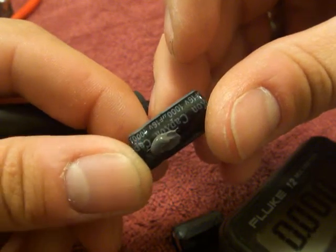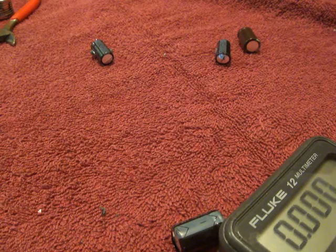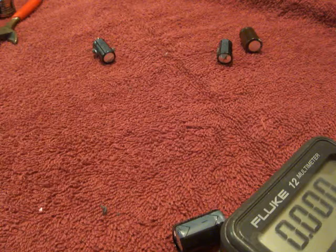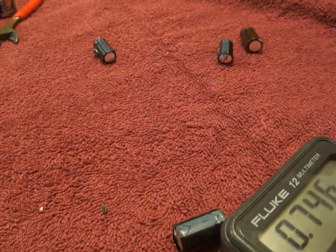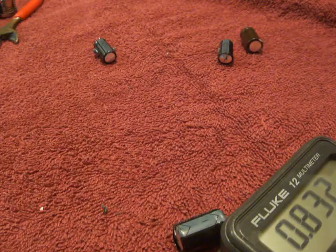I got this out of the LCD monitor — bad one — posted in my YouTube channel if you wanted to see it. But that's how you read capacitors, hope that helped. And you have to get a capacitor meter — this is the meter that you want, by the way. And you have to read it out of circuit; if you read a capacitor in circuit, you don't get an accurate reading.